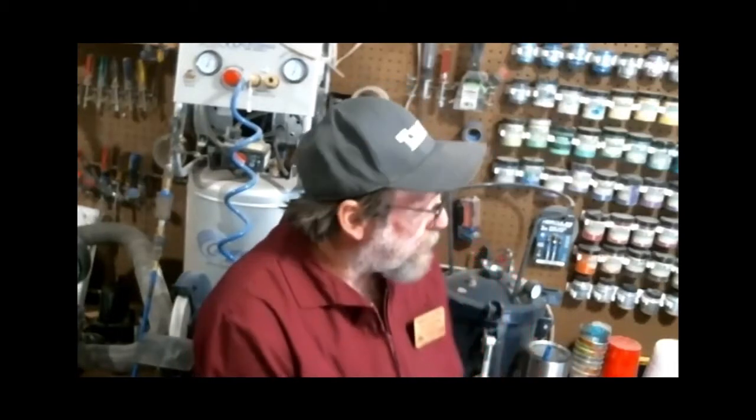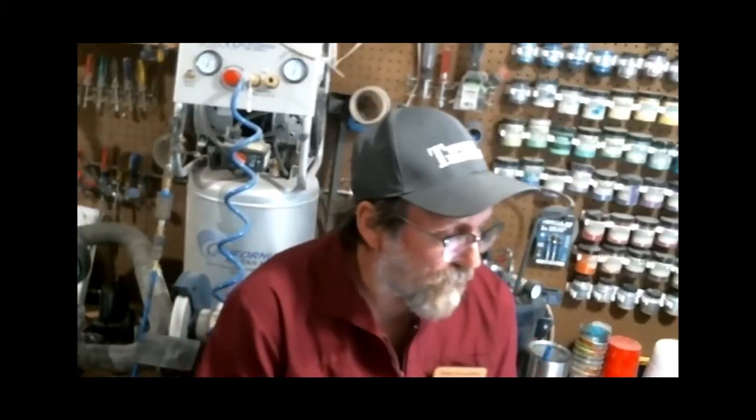So I can tell you about pressure pots a little bit, and we'll get into that, and we'll talk about stabilizing with vacuum with that. You can't use a vacuum chamber with this type of resin. Some epoxies don't set for 24 hours, so you can literally degas them in a vacuum chamber. Where this resin sets so quickly, there's no way to get the gas out of it in time in a vacuum chamber, so you have to use a pressure pot with it.